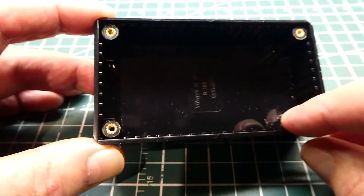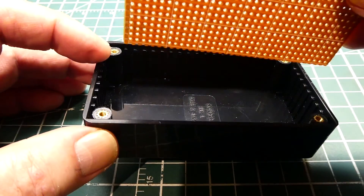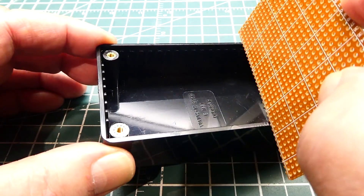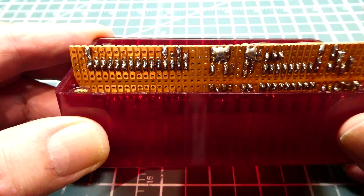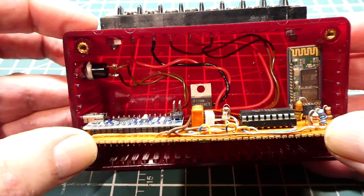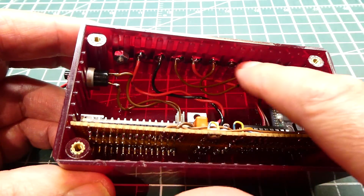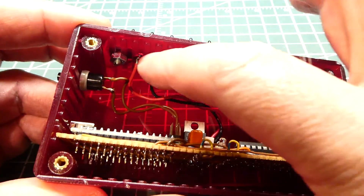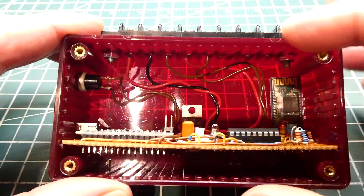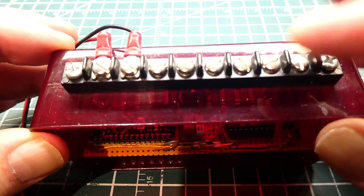The enclosure has slots all the way around the perimeter of the box, so we can cut Vero board to fit those slots — either orientation. Here's another box I built the same way: the Vero board with the circuit just slides in. On the top we have a terminal strip with through-hole chassis-mounted terminal block connections, so we can run wires for external power down into the box and have GPIO in and out to the terminal strip.